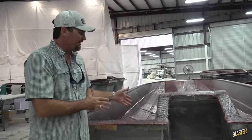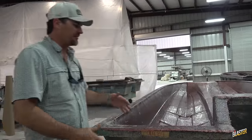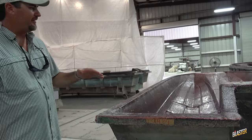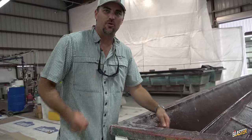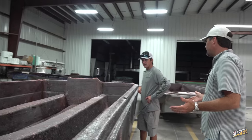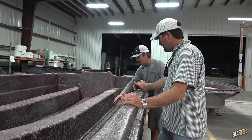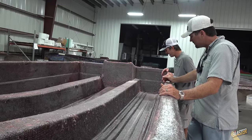We're in the next phase — this is where we're actually putting the fiberglass into the hull. Like I said, we work from the outside in. The first layer goes in, then a second and a third. We've got about five different layers throughout the entire boat and every single layer has to be hand-rolled. It's a very meticulous, time-consuming job. You've got to do it in a certain amount of time because it can dry. You can see all the lifting rakes and how intricate the mold is in the hull.